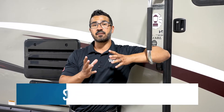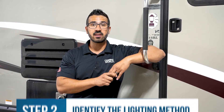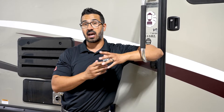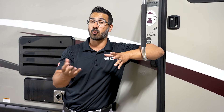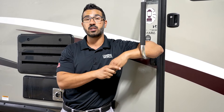Next, you want to identify the method of lighting your pilot. You'll have a few different ways — it may have a piezo igniter switch or a knob that when turned you'll see a little spark. You'll want to test to see if that happens on yours, because some models may have that piezo igniter but it's only for the cooktop. Some may not have anything at all, and that's when we'll use a lighter, which I will cover in just a moment.